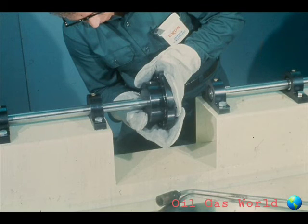When it reaches the required temperature, slide it quickly onto the shaft using asbestos gloves to protect your hands. Remember, any hesitation as you slide the coupling on will transfer the heat from the coupling to the shaft. The result is that the shaft will expand and the coupling may stick before you get it into position. If this happens, you will need to remove the coupling and start all over again. Make sure the shaft cools to normal temperature before you try again.